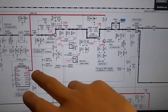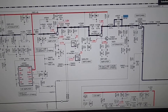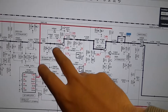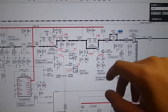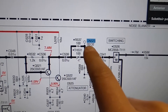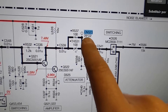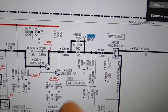Okay, so here is the second IF. I have the first and the second amplifier of the second IF — sorry, the second and the third amplifier of the second IF — and I have here a tap where it says 'second IF out'. I'm not sure where the first is, but it seems this is the second stage, and I will tap here on my circuit to feed the IF buffer.